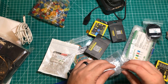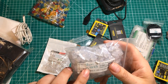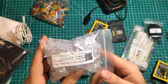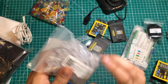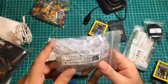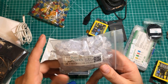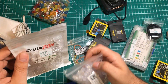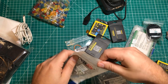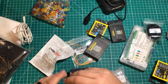All right, so these took me a second to remember. One of these is addressable — this is the PL9823, and these are essentially kind of like NeoPixels but in individual 8-millimeter LEDs. I'm going to have to come up with something to do with these because they are very very cool — the idea of just addressing these giant LEDs. These other ones are red and blue common cathode long-lead LEDs.